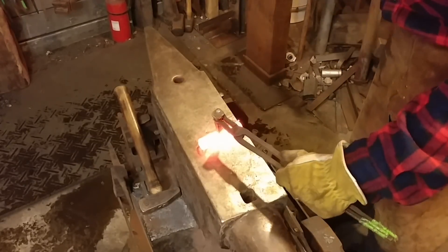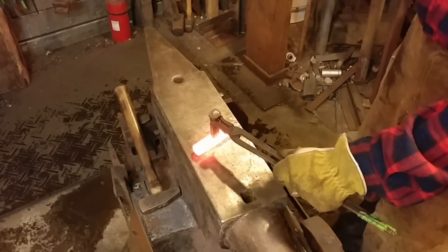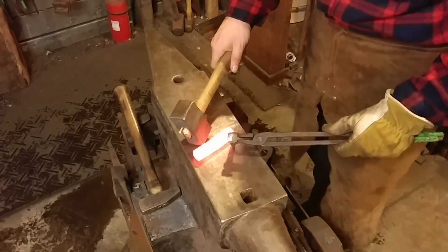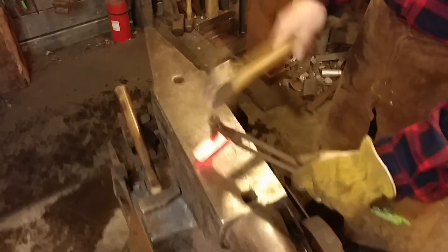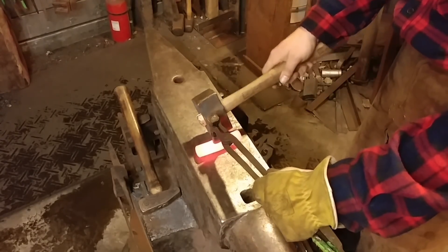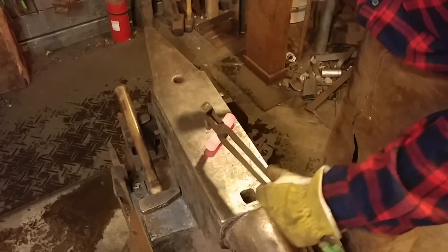This way it's not rolling all around on you. If you don't hammer flats, you may have to use something like a bottom swedge to actually hold the hammer in place, at least until you get those first initial whacks with the hammer and the punch inserted. This is a tong punch I'm working with, made myself out of a piece of 1045, approximately three quarters of an inch long.